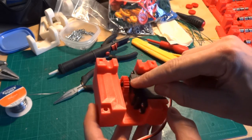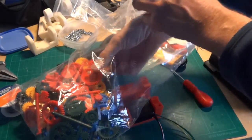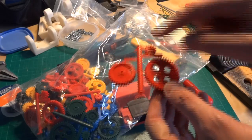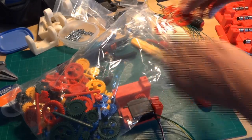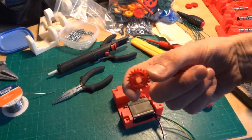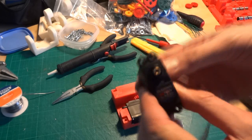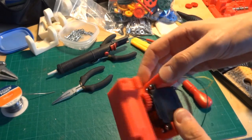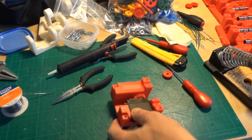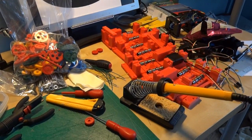The gear on there isn't really printed — as I mentioned last time they came from an educational website called Mindsets Online. You get a big bag of gears in multiple sizes — I think you get 20 sets for hardly any money. They're quite soft plastic, so basically what I've done is bored the hole out to 5.5mm, and that just pushes onto the servo shaft onto the metal thing. I've used the original screw and a washer to hold it in place — it's quite good that the red matches. So I've just got to modify the other three servos and then we can put the linear actuators back on the legs.